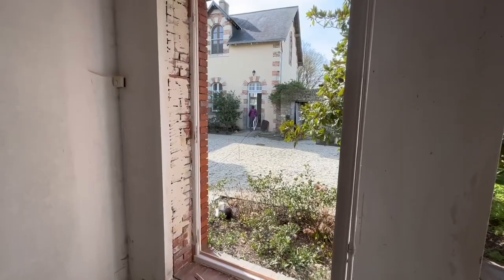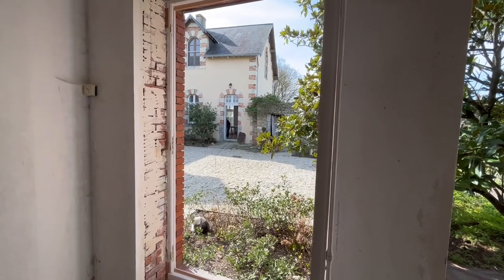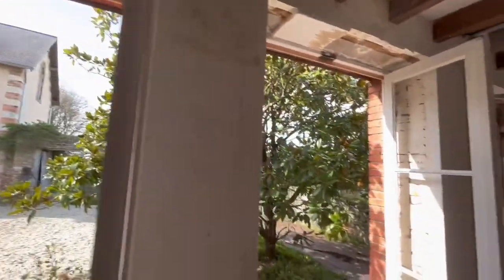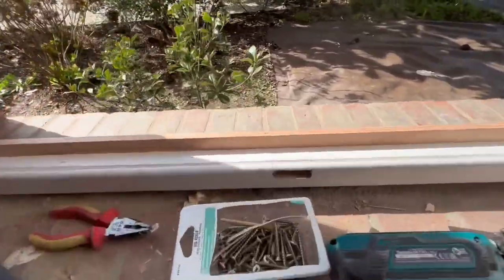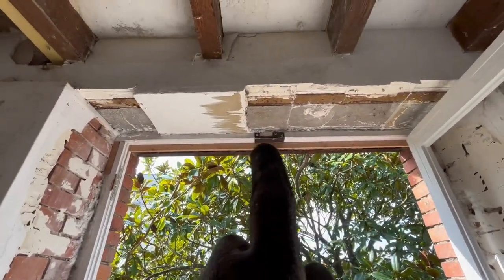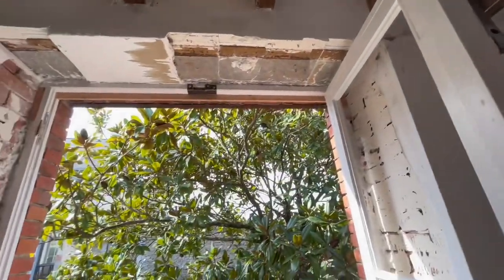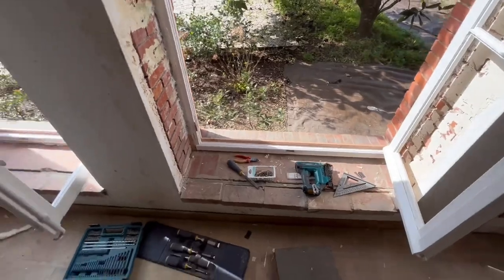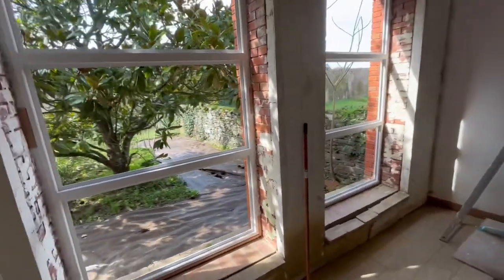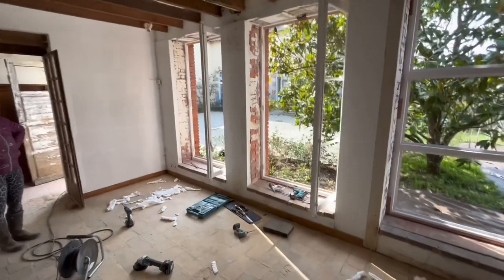On track anyway. Okay, there she goes. Just taking the sashes into the honeymoon suite. That means we're going to glaze. That also means that the espagnolettes, the mortise holes for the espagnolette hooks, are all done. So they came up quite neatly. Some a bit different than others. I'm just going to paint over that. I've had to rebate all those plates in, and then we're going to paint them, because all this has to be plastered and everything still and treated. But anyway, everything's locking nicely. So that kind of concludes everything in this room for now. So we're just going to head over and start glazing. Well, we can glaze these two, and that's it. So we'll catch up with you soon.